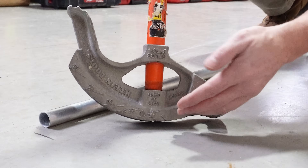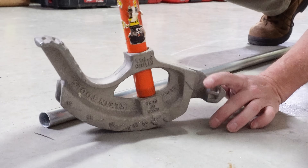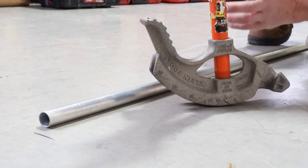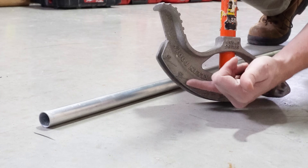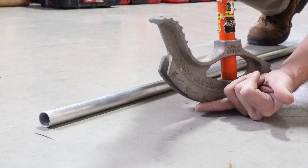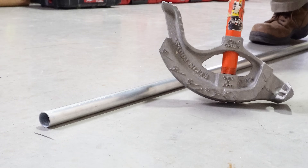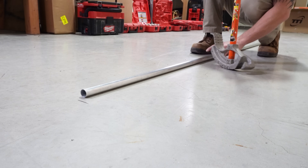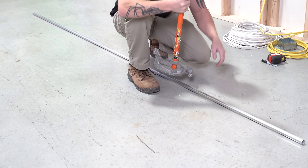If you're going to bend a 90, there's not actually a number 90 marked on here. So you're going to be bending all the way down until the end of the shoe almost hits the conduit — not quite, just almost. If I were to bend a 30-degree bend, you can see a line with 30 written upside down. I'd be bending back to the point where that line is parallel with the ground — that's how you get a 30-degree bend. We'll get more into that when we get into offsets. For right now, we need to make sure our arrow is lined up with the front line — not the first line with our measurement, but the front line where we took the six inches off.